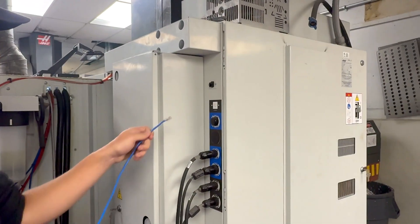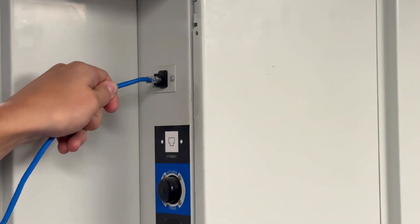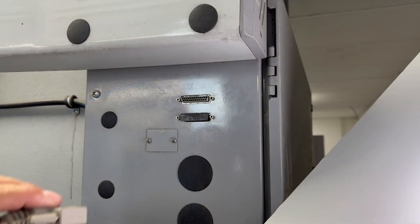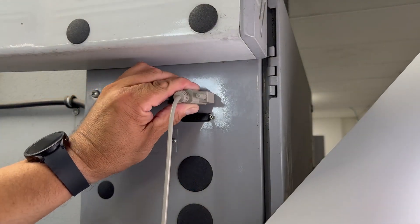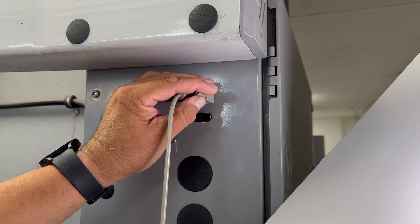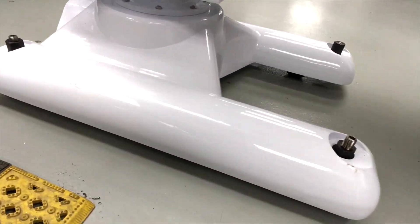Connecting OB-7 to your Haas machine is easy. For newer Haas machines built after 2022, you can use a simple Ethernet connection. Many cobots have trouble connecting to machines built before then, but OB-7 can still work with earlier Haas machines using the D25 connector included in the CNC package. As your jobs change, it's easy to move OB-7 from one machine to another, regardless of type or brand.